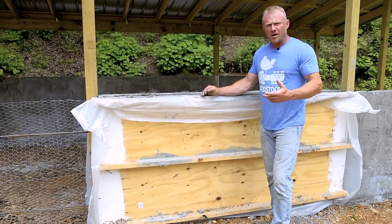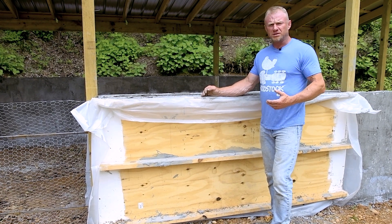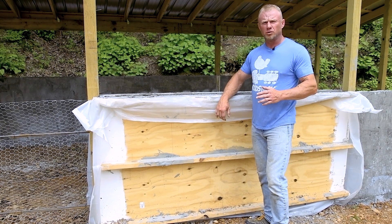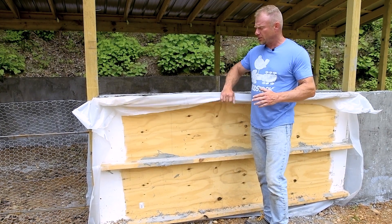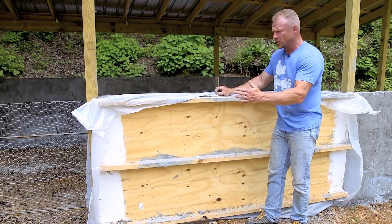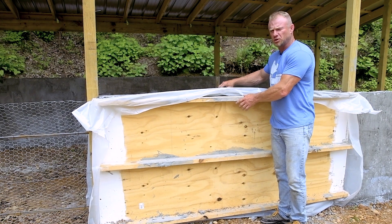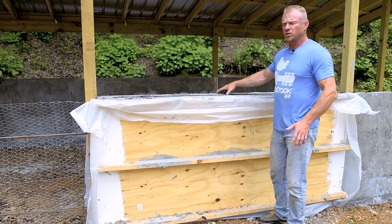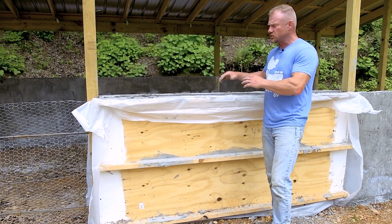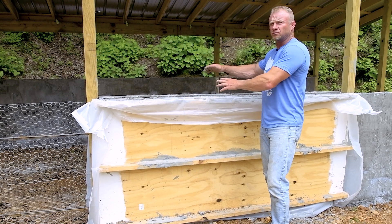After you get the chicken wire up and get it attached, the next step is the forms. We elected to use four by eight sheets of three quarter inch plywood. We didn't want the forms to distort or bulge under the weight of the aircrete, so we put two by fours at three different locations up and down to keep it from bulging out — three quarter inch plywood with three two by fours on each side. We're using the same form and we'll pour this section, then move it and pour the next section, so we're only using two pieces of plywood and six two by fours for this whole process.